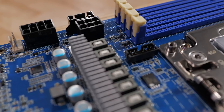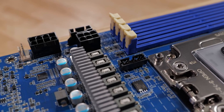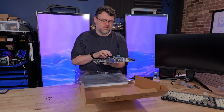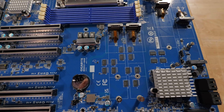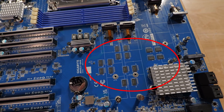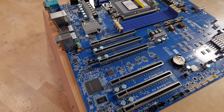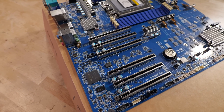Is that tiny and not overbuilt VRM? That's the first feature that you notice about the board. It's not overbuilt, but it'll get the job done. TDP of up to 350 watts are supported on the Threadripper Pro platform, which means you can run a 96-core CPU with this. Fully eight memory channels supported, and you've got a crap load of PCIe Gen 5 re-drivers scattered all over this board.